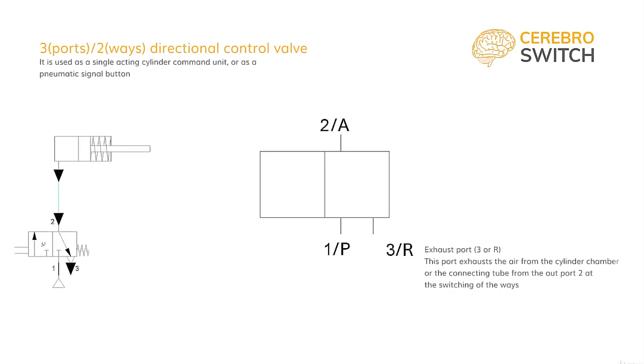Commonly the pressure and exhaust are interchangeable, but for now let's number it pressure on the left, exhaust on the right. Then we have to symbolize the flow direction in the given way. To obtain an equivalent function as the one before, where if you actuate the valve, it blows air, and if you take the actuation away, it will stop the air flowing.